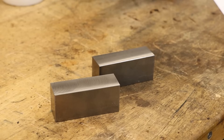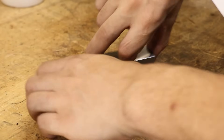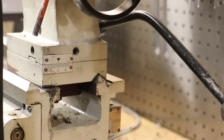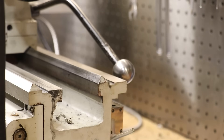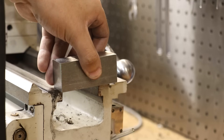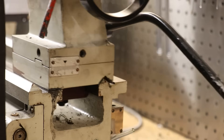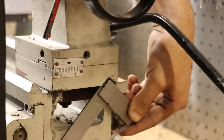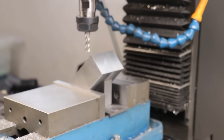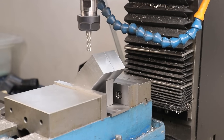And those are the two blanks now squared up. They're still a bit oversized so I can take them to final dimension at a later point. Now the next thing that I need to do is cut a slot for the prismatic ways. Now cutting these could have been a bit awkward because not all lathes use a 90 degree prismatic ways profile, but thankfully on this lathe it is 90 degrees. So I can now use an angle block to set the part up and I can now start cutting.